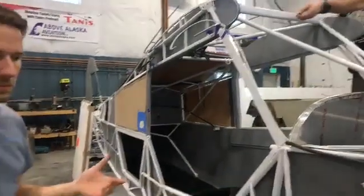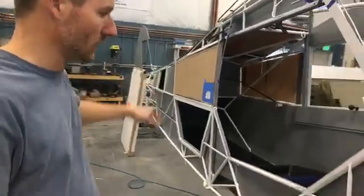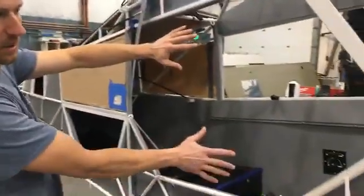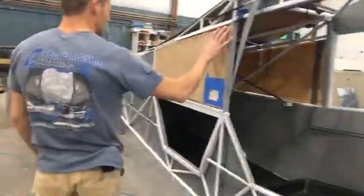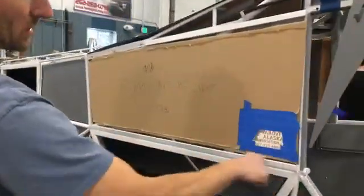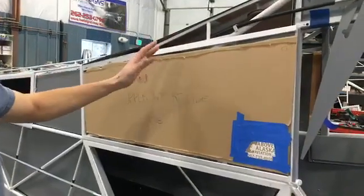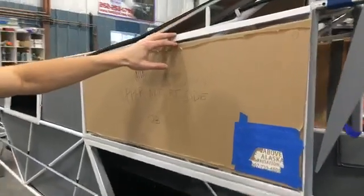And this is going to be the L21 version of the Cub, which basically puts in the big square windows. So standard clamshell doors, and we're going to do glass on the top and the bottom of that. And then we've got the L21 windows. Your standard Cub has the D window right here, so this extends this to all glass. We've got the protective paper on it so we don't scratch it. We've only removed the areas that we need to in order to get it to fit into channels and whatnot.